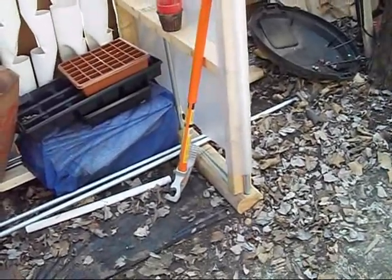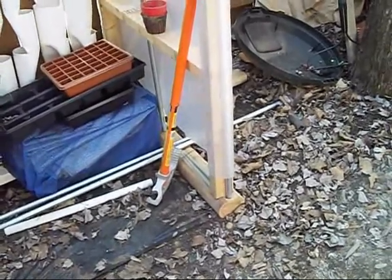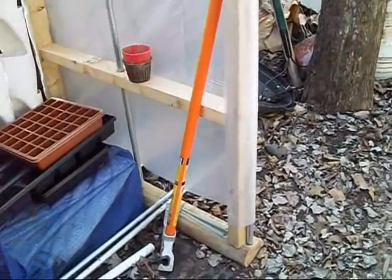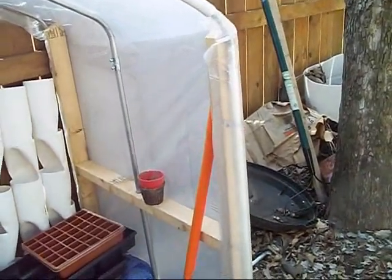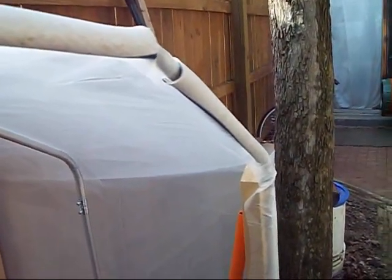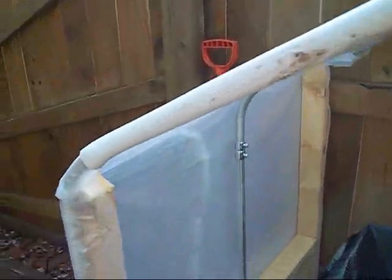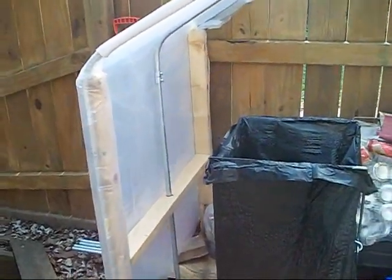Down at the bottom for this one, I just used whatever they call that kind of timber — it's like for landscaping. I drilled holes to accept the EMT, and then I attached the wood at the bottom with angle irons. On this one, I have a cross brace, because a lot of times you'll find you don't really need the sun coming in through that lower part. I also wanted to show here how I've used split hose to serve as the clamps for the plastic coming across here. This just serves to keep stuff dry so people can see the construction.